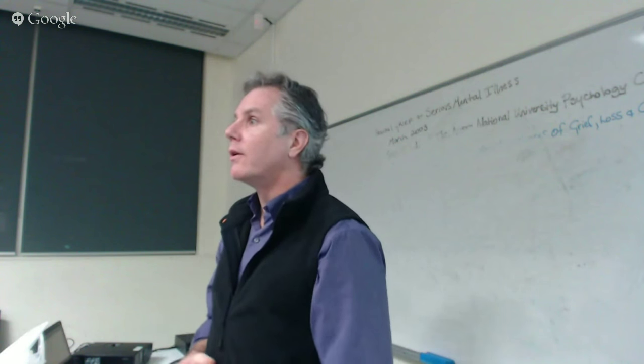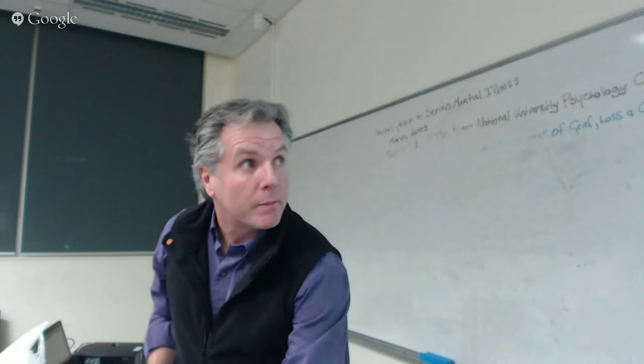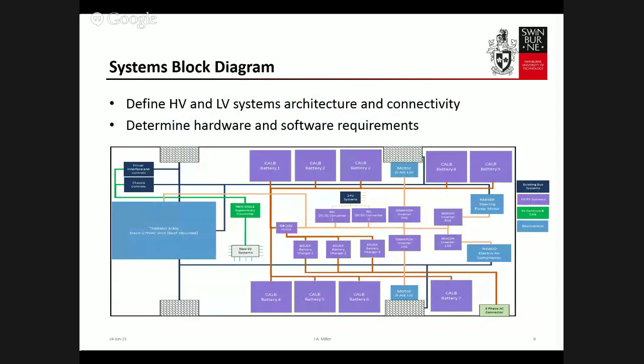First in series, then in parallel, or the other way around? So I've got a diagram that I can explain it probably a little bit better. First of all, the overall system block diagram, you can see here there are nine separate packs. So that's three in series and then three of those series strings in parallel. That's the way it's configured. We have a ThermoKing HVAC unit. The motors just inside each of the wheel hubs. High voltage and low voltage system supervisory control, and the individual level controllers. Overall system configuration.